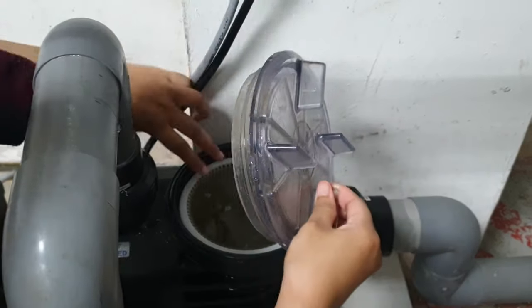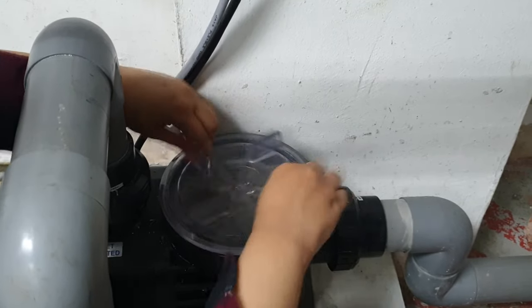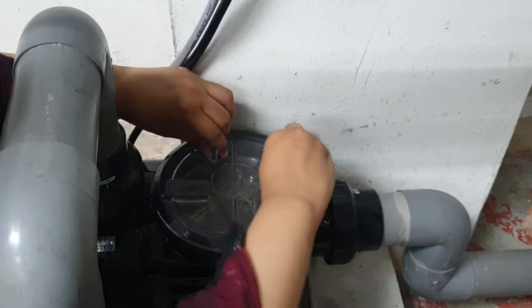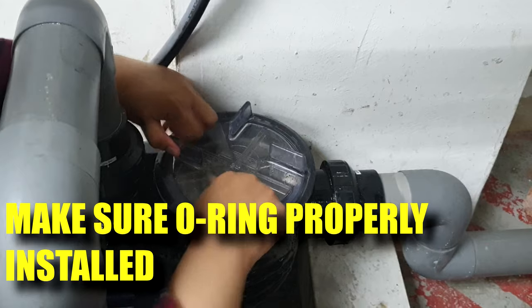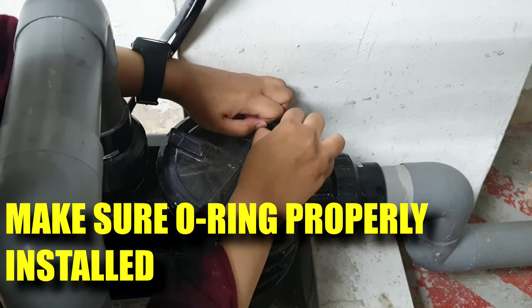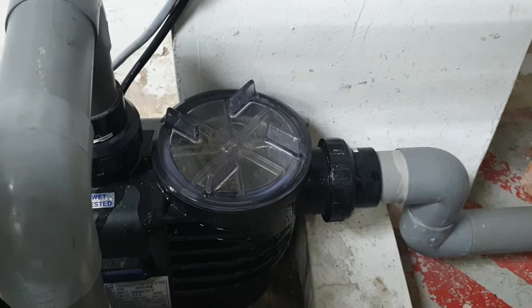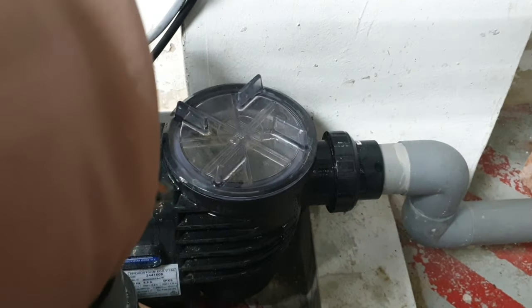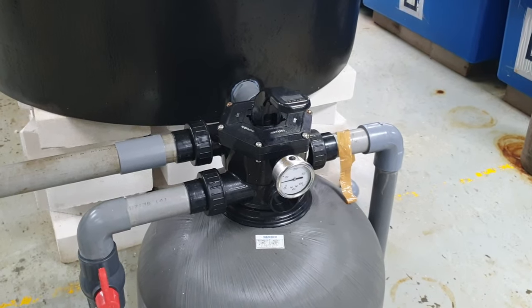You need to make sure that the hole aligns with the inlet and then seal it off again to ensure a good seal. When you run it, you should have no leaks from the lid. Make sure there is an O-ring installed before you fit the lid and that everything is tightened. This step is really important to make sure your pumps are working at optimal flow so they are able to deliver enough pressure and flow through the sand filter.